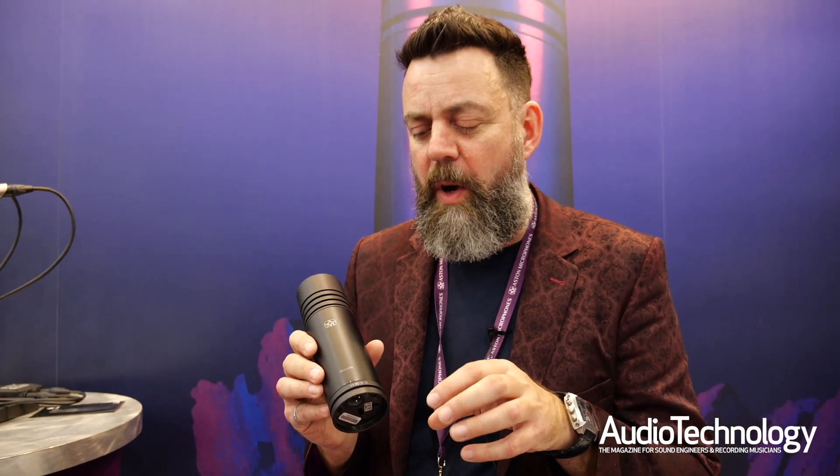In addition to that extra flexibility, you've also got four voices which are active in both passive and active mode. This is not something we've done digitally — it's actually hardwired into the analog circuitry. There are four separate discrete circuit paths, one for each voice, that are mechanically switched between, so it doesn't matter whether you've got this in active or passive mode, the voices will still work.